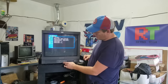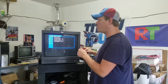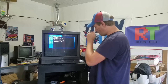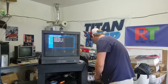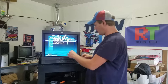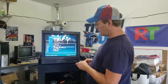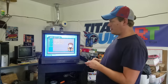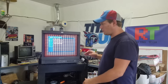I'm not as familiar with this menu, so we might work through some troubles as I go through it. The first thing that comes up here is deflection, as you can see on your screen. While that's doing that, let's go ahead and power up the Super Nintendo. And there we go — no more flickering on that screen. So what I like to do is get into the 240p test suite, and the best screen under the test patterns is the grids for geometry, as well as the linearity screen.